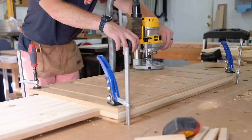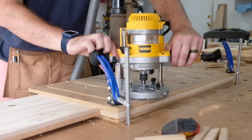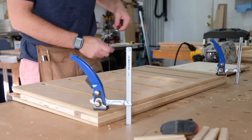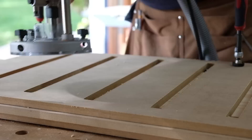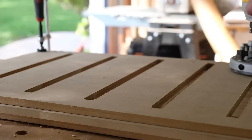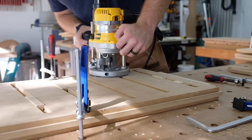The dividers have dados on both sides, so they took a bit longer. This happens in four stages. First I rout the top face dados and then install my reference blocks. Second, I flip the jig and route the opposing face. Third, I take the reference blocks out, slide the board down, reinstall the blocks, and rout those dados. Fourth and finally, I flip the jig back over and route the remaining dados from that first face. If I had a full-length jig, this would only be a two-step process, but in the end it gets the job done and the dados are as accurate as I could hope for. A larger CNC would make this simpler, but that's not in the cards at the moment.